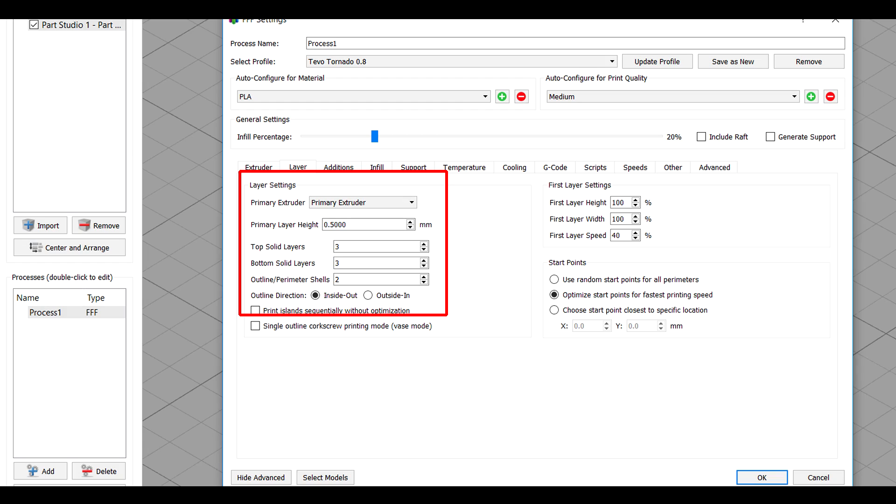Now onto the more common slicer settings. I did all of the prints in this video at 0.5mm layer height. The rule of thumb is that you need to go at a maximum 80% of your nozzle width, so that's a 0.64mm maximum layer thickness for this size nozzle. Because each extruded line is so much thicker you can reduce your amount of shells or perimeters — I normally print with 3 and I dropped that down to 2. For the same reason you can also reduce the amount of solid layers on the top and bottom — normally I have 4 and on this one I could safely drop it down to 3.